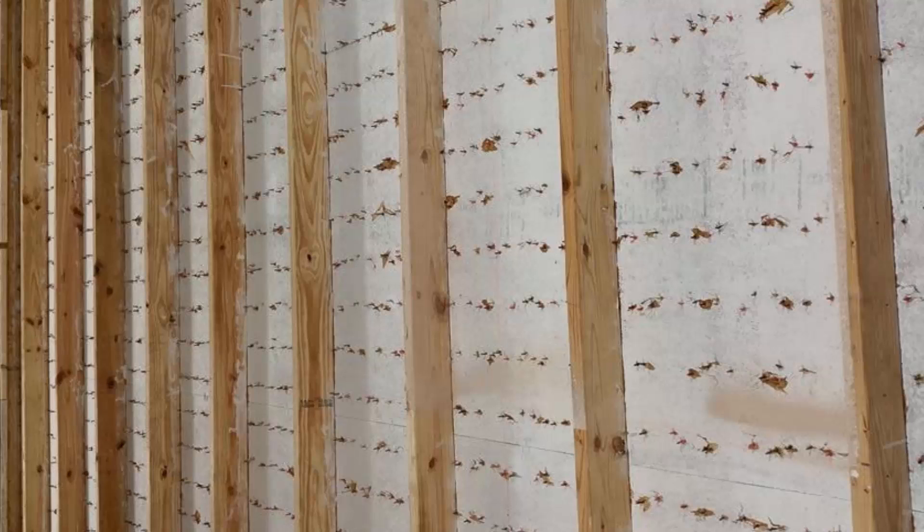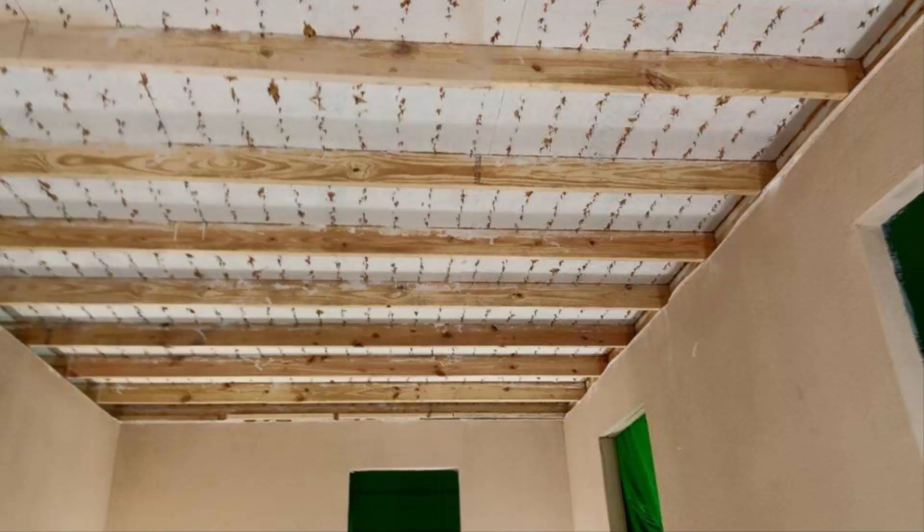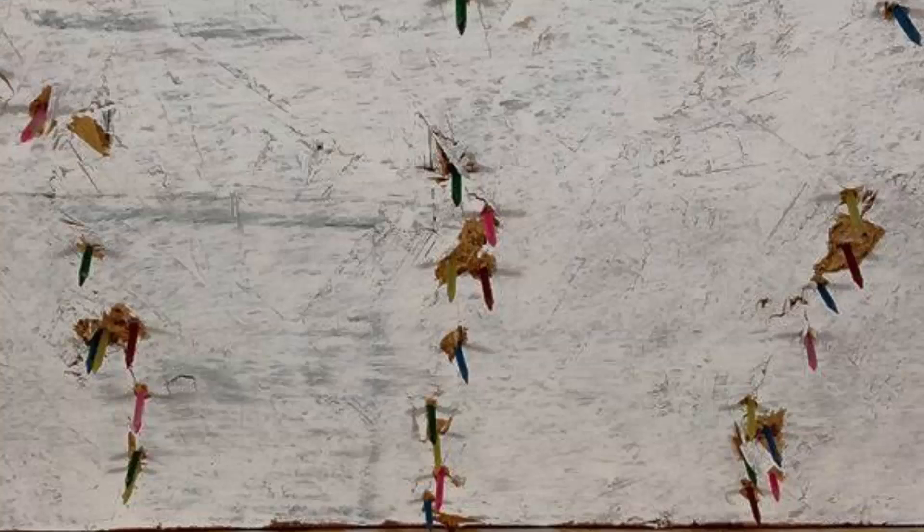All things being equal, the nail lines for the new shingles would fall in the same place approximately every six inches as they did on the original roof. Most of the time the nails would find good solid decking, but occasionally the nails would be driven directly into a prior nail hole or close to a prior nail hole.